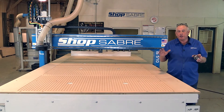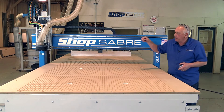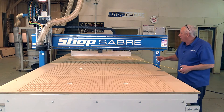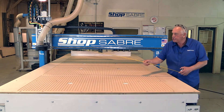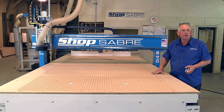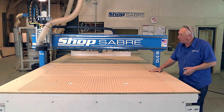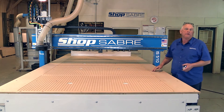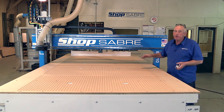Now let's take a look at the table. One of the things you want to consider when looking at a machine tool is its work envelope — that's a 3D volume that specifies where the machine can actually reach with a cutter. Part of that is related to table size, or actually axis travel. While this machine says five by ten, you'll find it's bigger than that — we pretty much make our tables about a foot wider than our spec. That lets you occasionally machine a larger part, and on this particular model it allows us to install a boring block after the fact — really nice if you're doing cabinet parts or closet parts. The other part of work envelope has to do with Z: the clearance under the gantry and the Z-axis travel. Our machines have about four inches of Z-axis travel more than the gantry height, so if a part fits under the gantry, you can pretty much machine it.